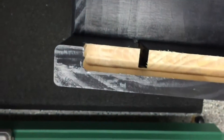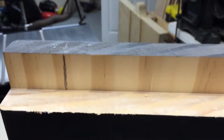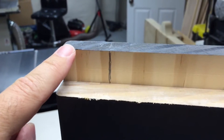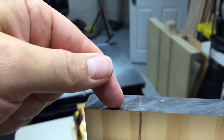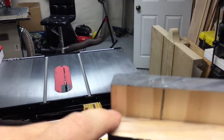I'm supposed to be about one and an eighth inches from the edge, but I'm a little bit shy of that, so I'll just clean that up with a chisel. The original leg ends right here, but my leg is a little bit wider so I'm going to have to make another little cutout about a quarter of an inch deeper.